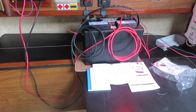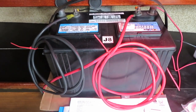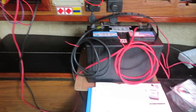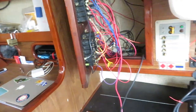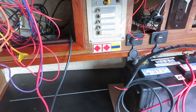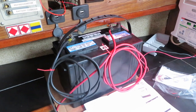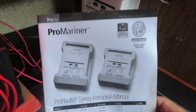This is temporary mod zero-zero-two: that looks like a car battery but it's a marine battery. I took it out of the port side locker and put it on the counter, and that battery is running my house loads — ground and positive cables to keep the back side of my panel energized so I can use the lights. I worked all day on removing the engine start cables and all the heavy cables and didn't get finished with solar, so I wanted to have a backup.